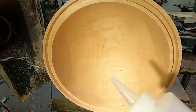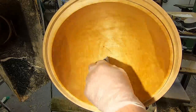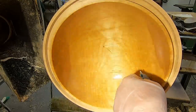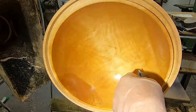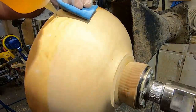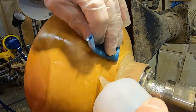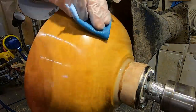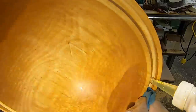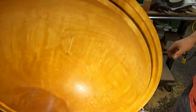The first coat I put on really, really heavy — I really want it to saturate the wood. It's really important to seal the end grain on birch. Birch is very, very porous. If you happen to get a CA glue run on the end grain of one of these bowls, you may not be able to sand it out. That's not the case with walnut or hard maple. Soft maples are probably in the same category as birch. Just putting it on real heavy, glued in the groove so the glue doesn't wick out through the end grain and stain the outside of the bowl.